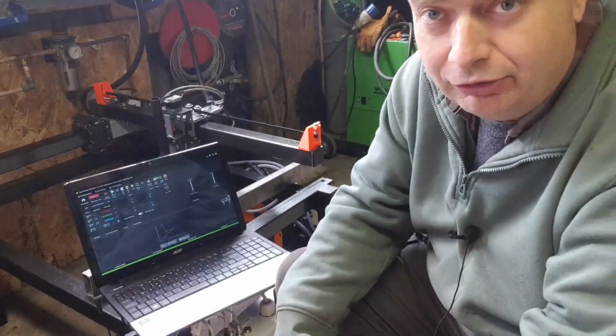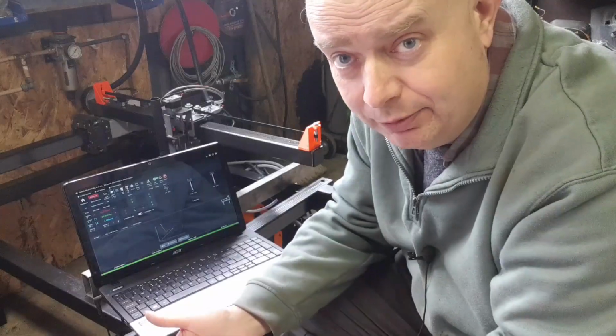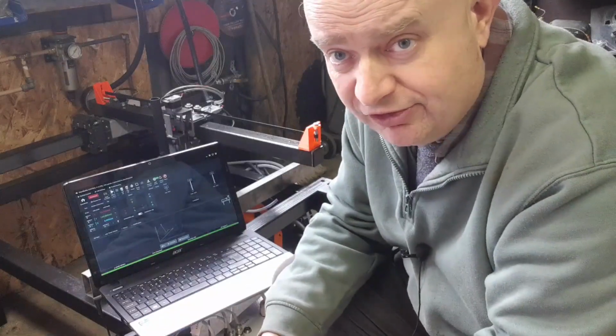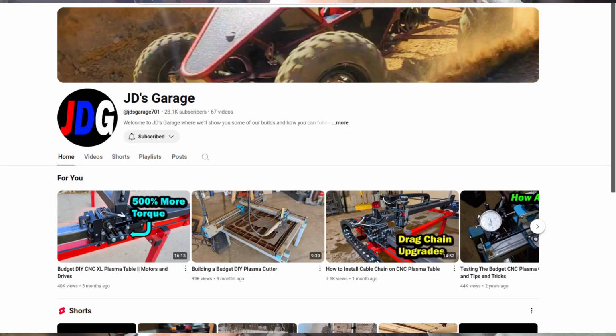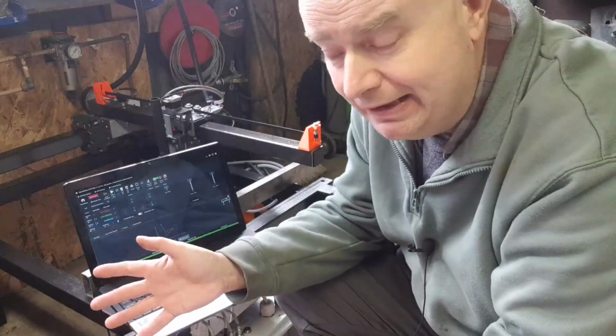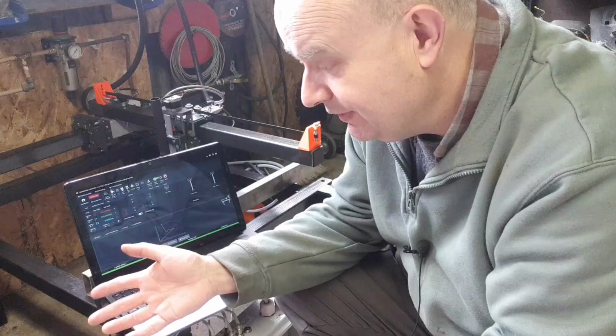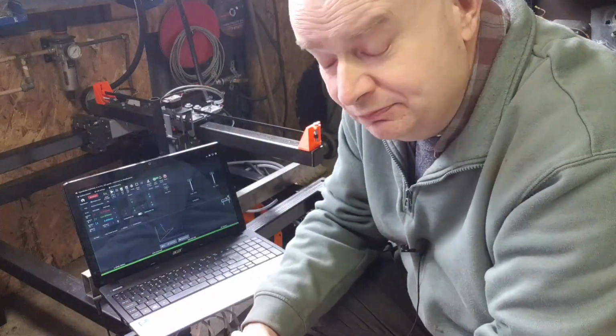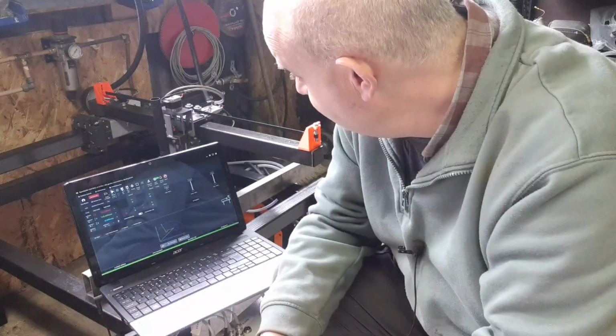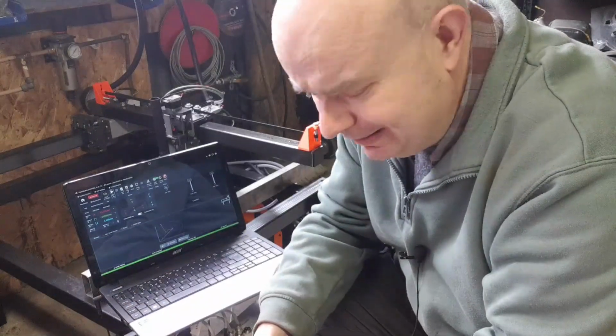Even the control panel here is made up of simple stepper motor drivers, an ESP32, and a 24-volt power supply. And they give you the schematics and all that, so if something pops in that, you can pretty much change it out. So it's a maintainable system without needing any third-party business to decide to stay in business for as long as I'm going to need to be cutting out parts.